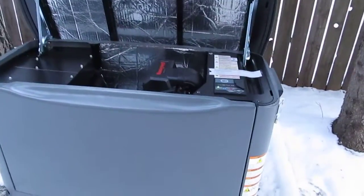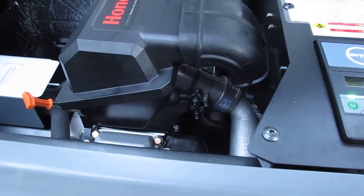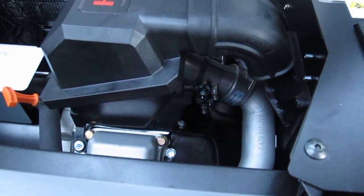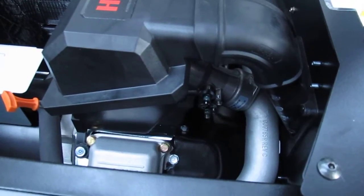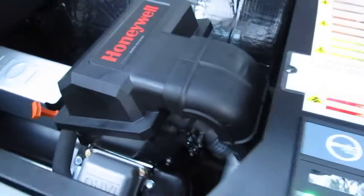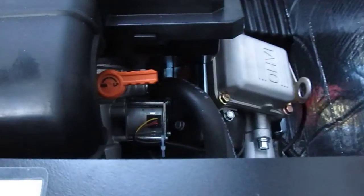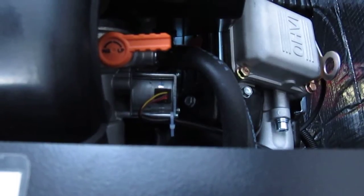There's a mixer assembly down here — basically it's a carburetor. Normally what happens when you do a start is that linkage down there moves, and I don't know whether it sets a choke or gives it a little shot of natural gas, but that wasn't moving. On the other side is the electric part, called the governor actuator — that's the electronic control that actually moves the linkage.